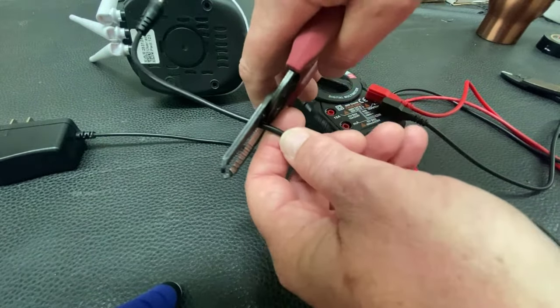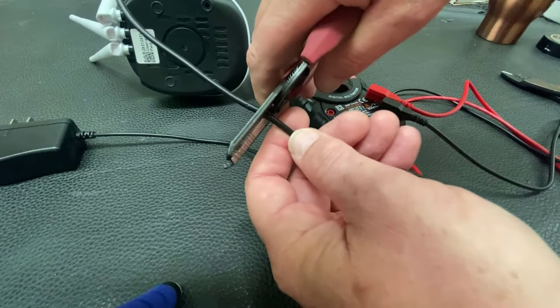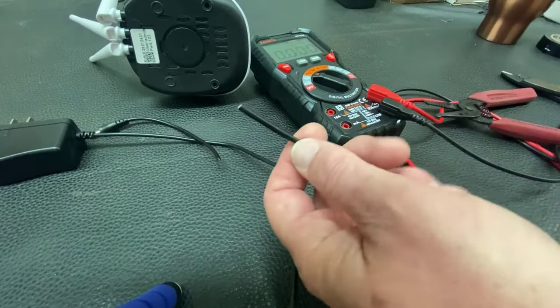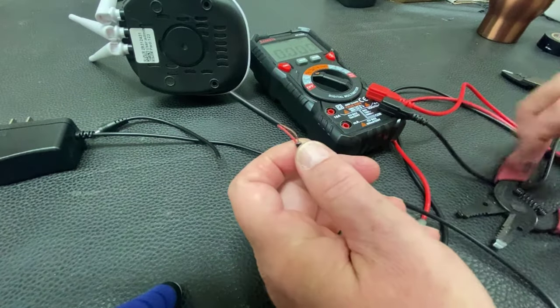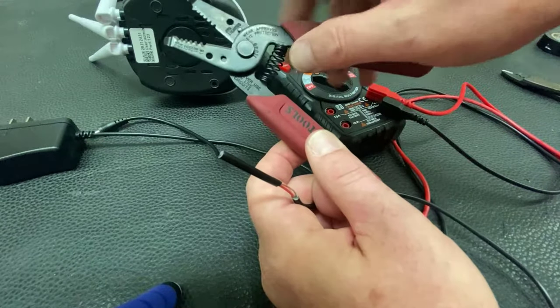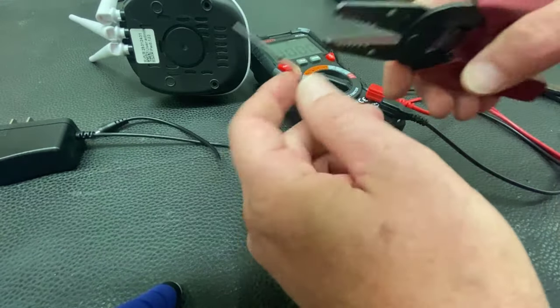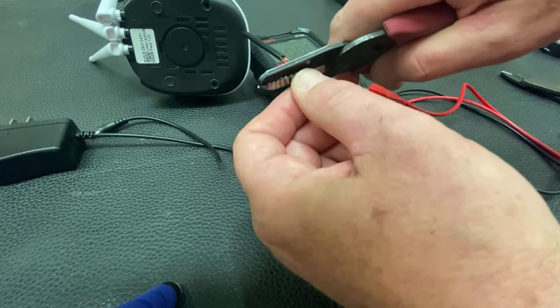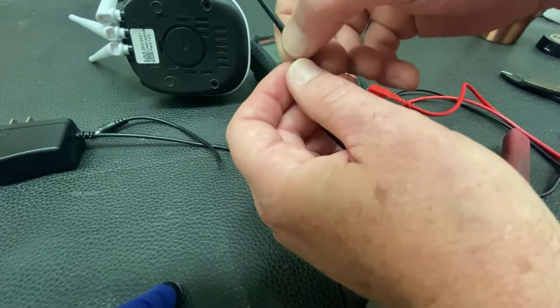Imagine you're a do-it-yourselfer and not a professional at this kind of thing. If you have the proper tool for the job, you might want to find the right gauge size wire strippers. Otherwise, you're going to have to just grab it — squeeze down just enough to grab the insulation and pull it forward. You don't want to cut into the shielding.